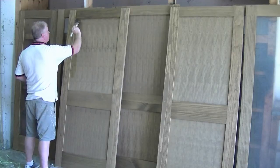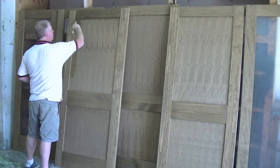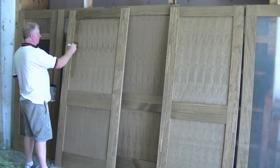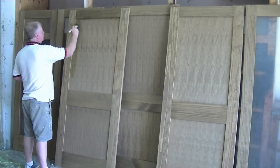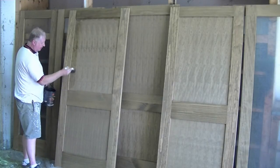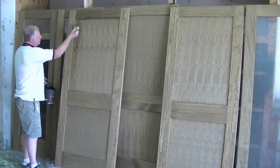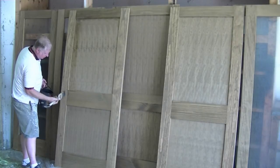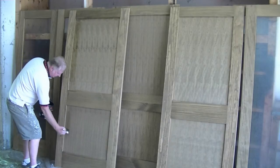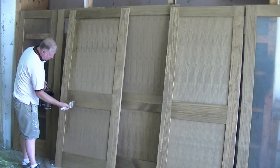It's not like staining where you have to be careful about working across the grain. Just brush it all out. So there we have a run — pressed too hard on the brush. Just like we were staining, we have to deal with this right away. Wherever there's a drop, you just want to brush it out. Feather it out where it sits, but go with the grain, because we're going to be brushing with the grain.